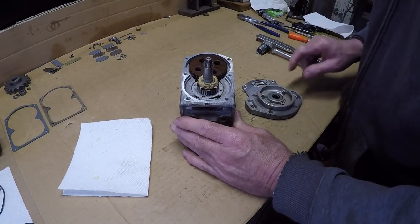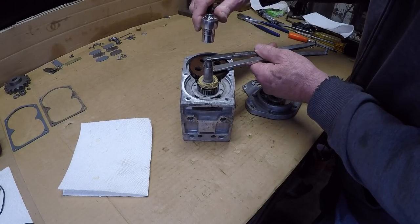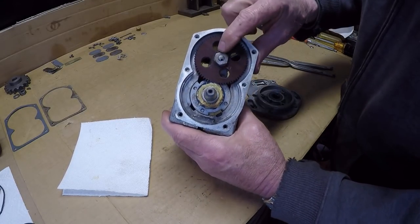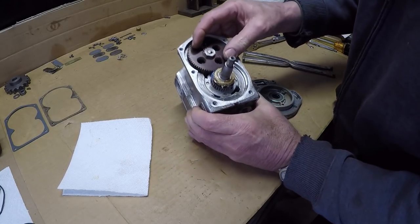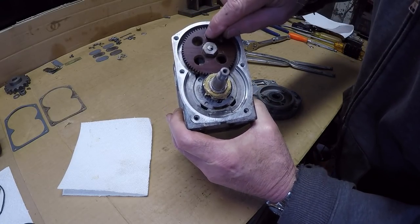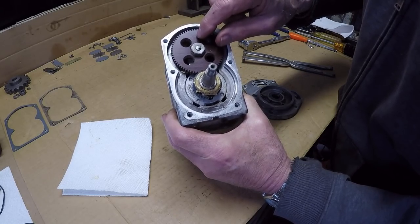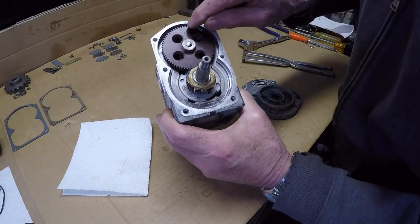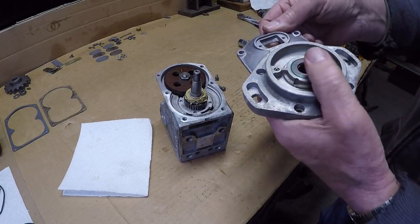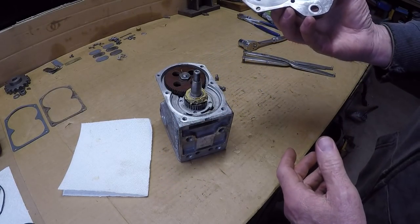Nut's installed and tightened down. I've got an adjustable spanner — I set that in those holes and take a socket wrench to tighten her down, make sure the through hole lines up through the nut and the shaft, cotter pin it, fold the ends over, ready to go. Double check — make sure timing is on — still looking good. Now you'll see this line up here — it's not quite centered. That's your mag timing line when you check your mag on your flywheel. That'll come around straight up. That line should be lining up with the arrow inside of here when you put this on the pony motor.